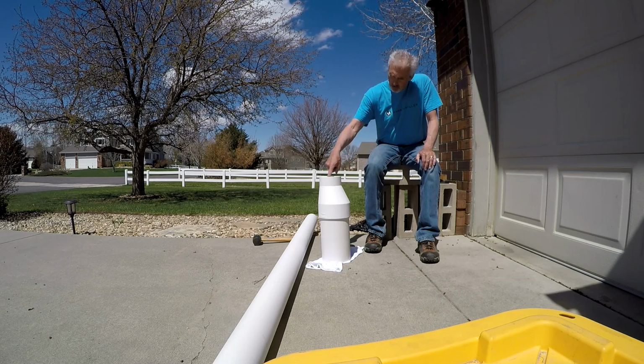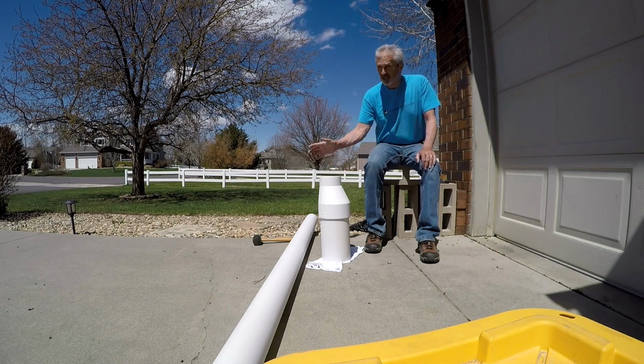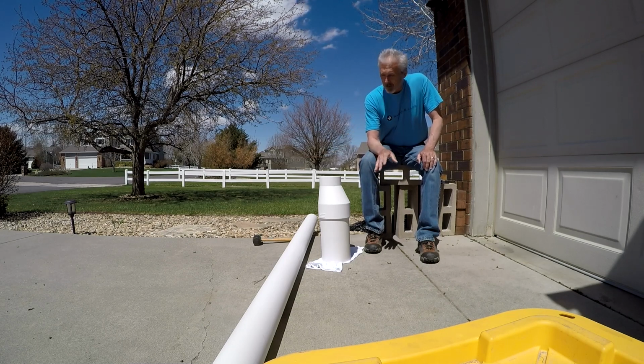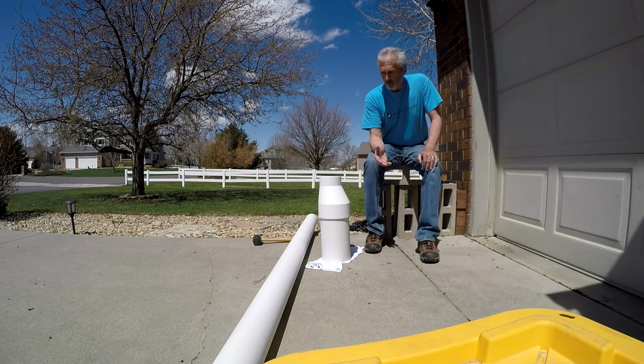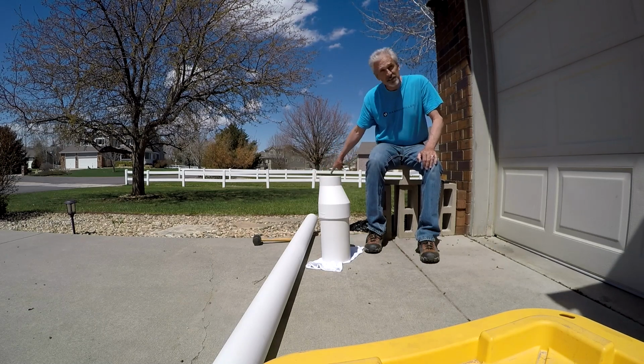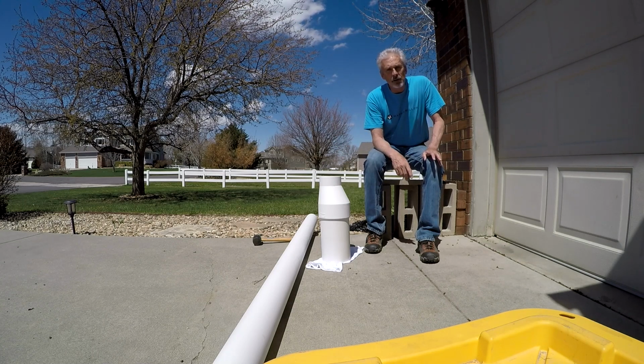Okay, we have our 6-inch PVC glued to our reducer, and now we're just going to continue on with the gluing process. We're going to lightly sand the inside of this, and just a note, if you are going to paint this later, make sure you sand everything before you glue anything. It's so much easier to sand it now rather than once you have these little joints and stuff to worry about. So do your sanding, then do your gluing. So sand the inside of the notch on the eccentric reducer, apply some primer about 1 inch up on the PVC, let it all dry, coat it with your glue, slap those babies together, and let them have a good dry. And then you'll continue on with the end cap as well. And then we are pretty close to being finished with that.